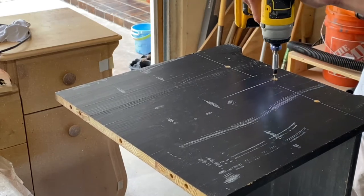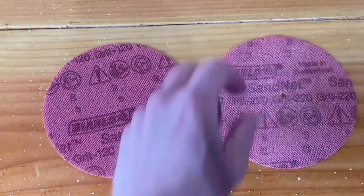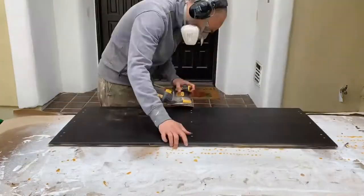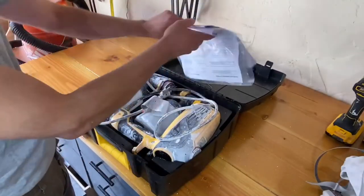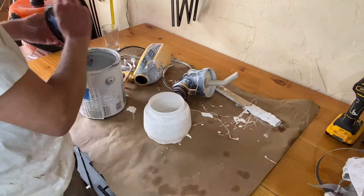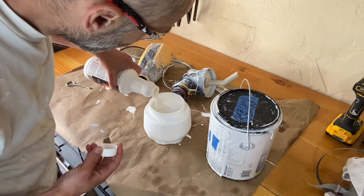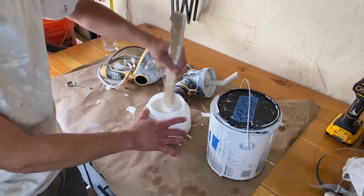By watching this video and following the techniques I use, you can restore a piece of furniture for whatever purpose — whether for resale or to keep it. I'm going to use 120 and 220 sanding nets and you want to be kind of delicate when sanding depending on the finish you're going to apply. I'm going to paint it, so I just need to make sure I create the correct type of surface. I'm a fan of my Wagner Flexio sprayer and that's the tool I'm going to use to paint this piece. I'm going to use a primer because the color previously on the piece was black, so it's important to cover it with primer and make sure the primer creates a good transition for the new color.